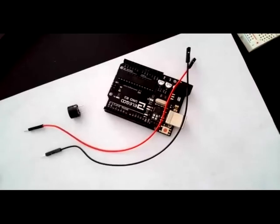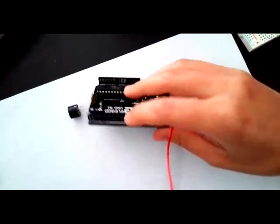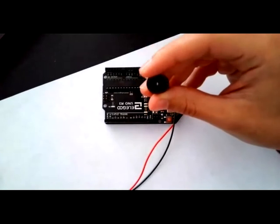For your second lesson today, we're going to teach you how to use the passive buzzer to make a tone or a melody. This happens by vibrating the air outside of the buzzer to create noise. So what you're going to need for this is your Arduino single board microcontroller, two wires, and a passive buzzer. The passive buzzer is the one in your box in a clear bag without the sticker